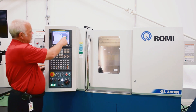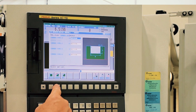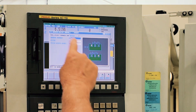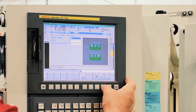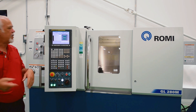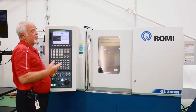What's great about this is you can define all the different corners. On the top corner, we're going to say a .030 chamfer. Down in the bottom, we're going to say nothing because we want it to be a sharp corner. Then on the top again, a chamfer of .030. Then we press insert. And if you have multiple grooves — if you had five of them in a row — you could tell it to do that. We're not going to do that, but you have that capability. Then you insert that.